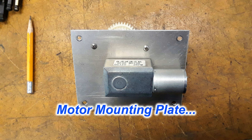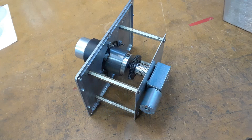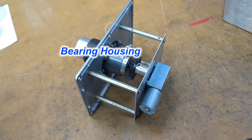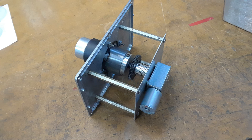I built up a backplate for the little motor to mount to, and it was held off by standoffs which connected to the top plate of the aluminum box itself. In this picture, you can see the pipe that turned into the bearing housing, and there's a flexible coupler that joins that aluminum azimuth axis I laid up to the motor itself.